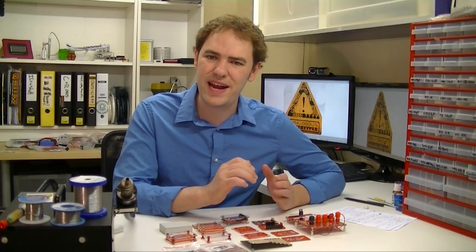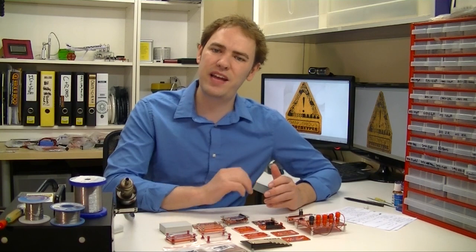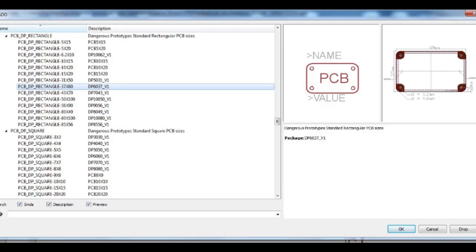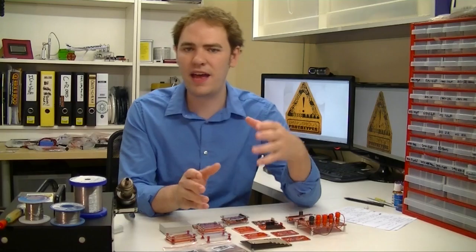Having a standard is great, but the important thing is it's easy to use. If we've got the standard and we still have to lay it out on our PCB every time we make a board, it's just going to take too much time. It has to be absolutely effortless to use. So what we did was come up with a CadSoft Eagle library — a template — and all you do is drop the template onto your schematic and the right size and dimension board automatically appears. Then you just route on top of that and you know your board is following the SICK of Beige standard.